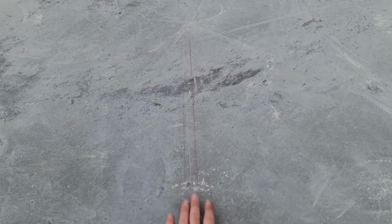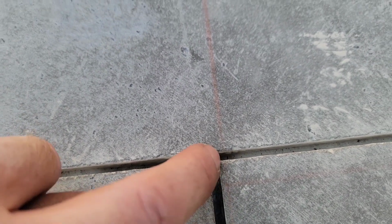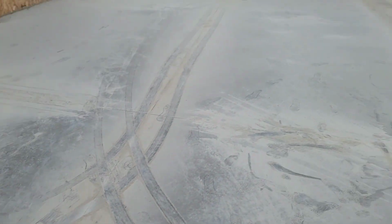This one right here, we stopped it right there because I didn't want to go through the drain and I didn't want to get into this pad right there. So that's where I had Alton spot me, and I said, Alton, don't let me touch that spot. And we got it. I'll take my 4-inch grinder. I've got a masonry blade on there and I'll cut that by hand to open that up. But hopefully this gives us what we need to control the cracking.